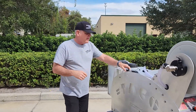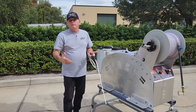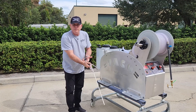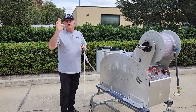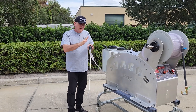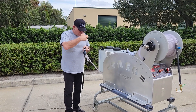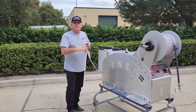Remember, your soap is static. What we've included with this system is a soap stinger. Whether you're using soap from a five-gallon bucket, a one-gallon bucket, or an auxiliary tank, there's a nice little on/off switch, a primer ball for priming your soap, and a draw tube to put down into the bucket. It's always at two ounces per gallon — you never have to think about setting a soap valve. You can also switch between soft washing surfactants, waxes, gutter brightening chemicals, and use different chemicals in combination with your bleach.